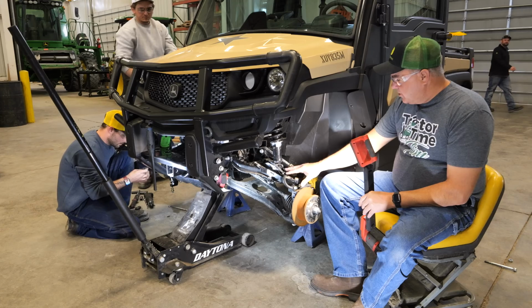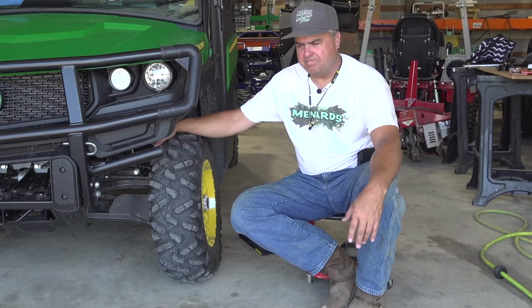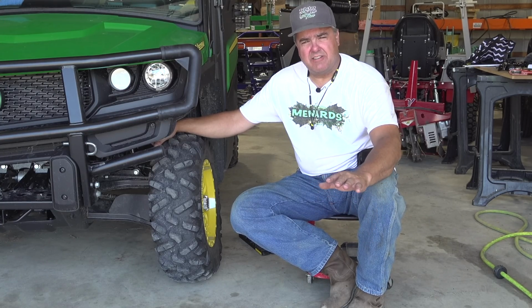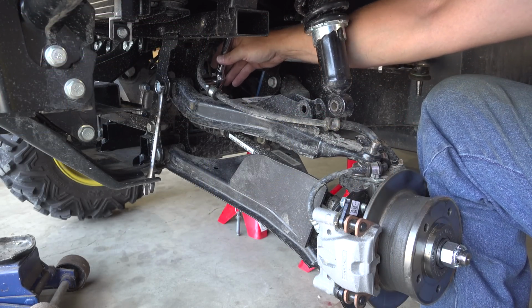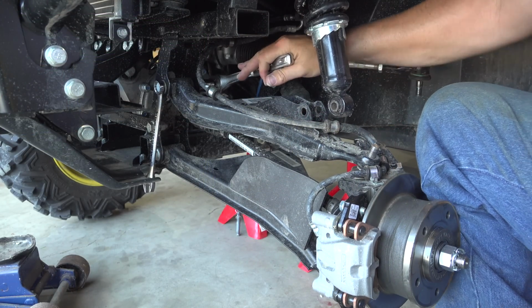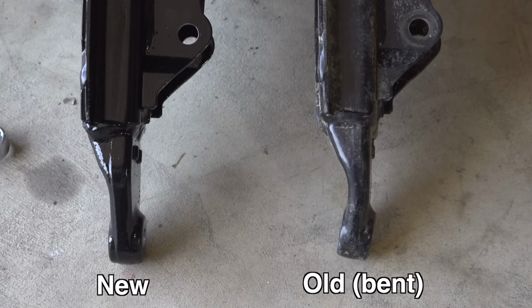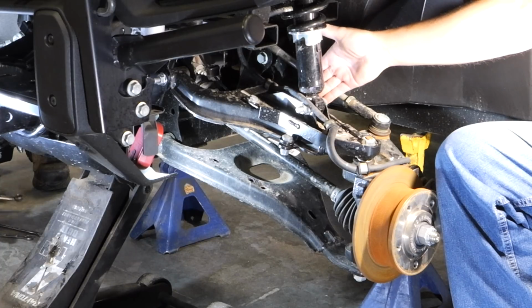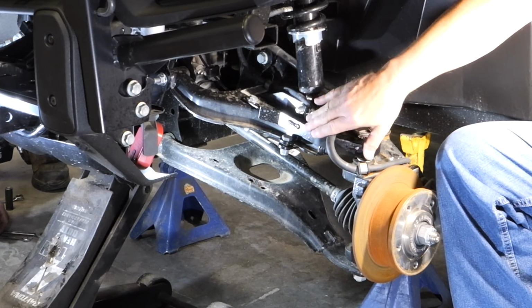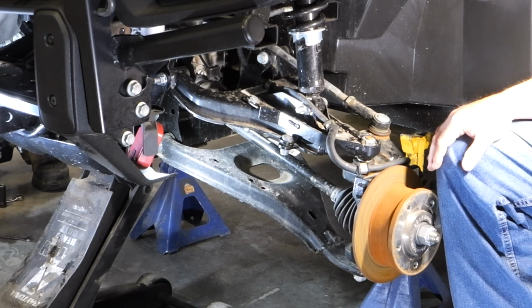So while the guys are working on the other side, I'll show you this piece here. Now this brings back some not so good memories for me. If you've been watching our channel a long time, when we first got our 2018 Gator, well, not when we first got it, but somewhat later, I allowed a couple of 14-year-old girls to just take off and have a good time with the Gator. Well, they did, but the result was that my upper A-arm got bent. And so I find that kind of interesting in light of what's going on here. Camso has provided an upper A-arm stiffener that goes right here to stiffen that upper A-arm, presumably for that very reason.